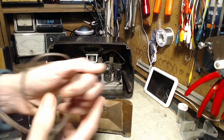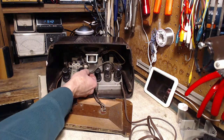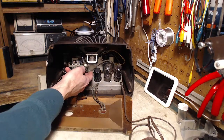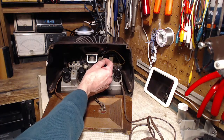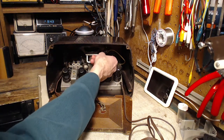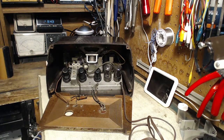Looking pretty good inside. This whole back plate is on an angle so these tubes are all angled. There's a light sitting here — that's kind of a crazy spot for the light, just in the middle of the radio. Looks like a hand-twisted wire connection from the output transformer to the speaker. That's a voice coil — oh, it's ripped right out of the speaker. Off to a bad start; that's the kind of thing that's tough to deal with.